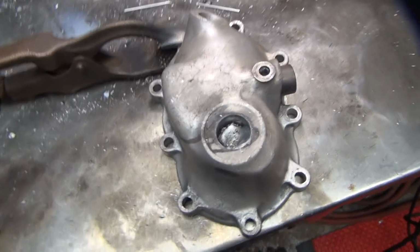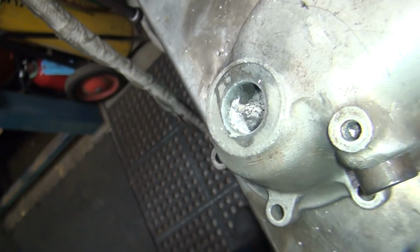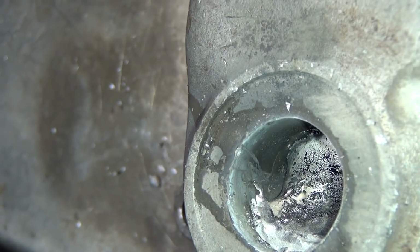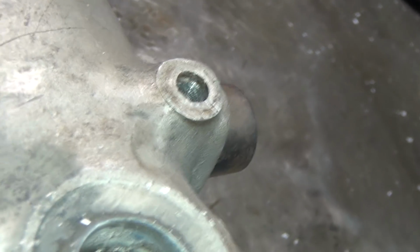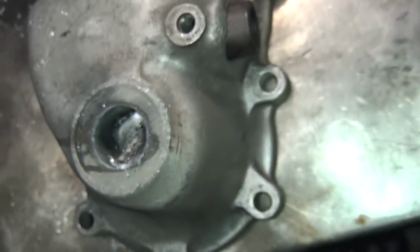Okay, I think I got it welded up. Had to put a bunch of material right over there to fill in that low spot. That looks like it's parent material, so we're alright. And that all looks good all the way around there. And it's melted right in, not undercut. So we're good.